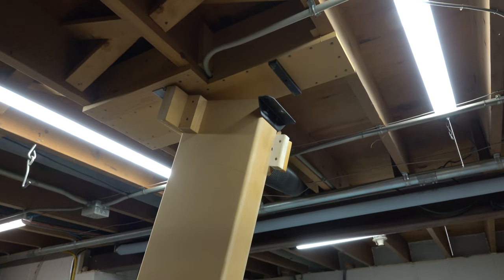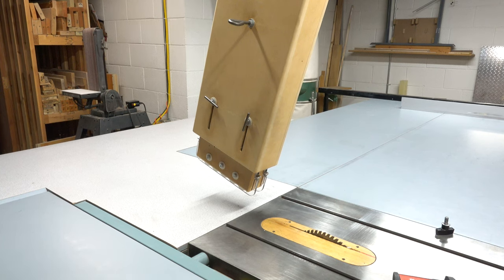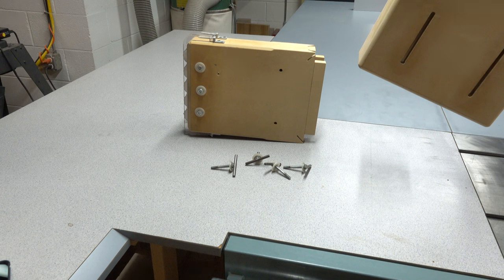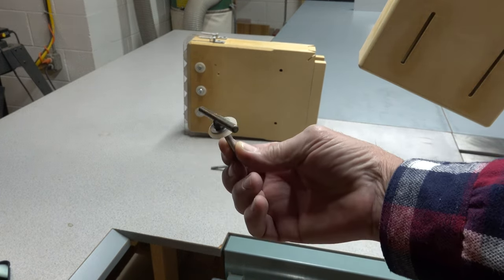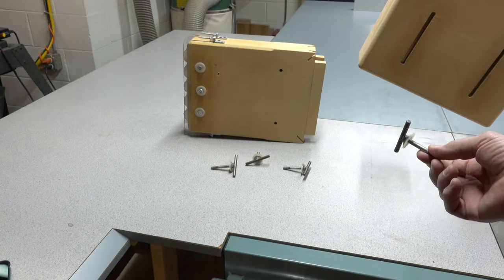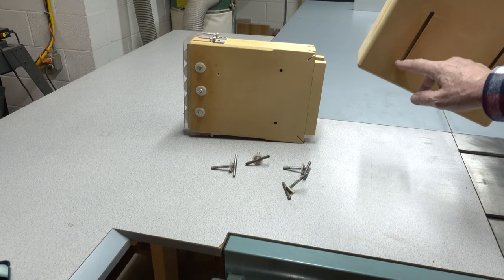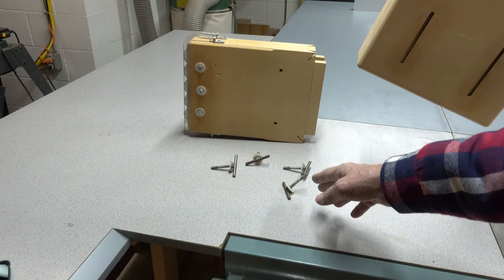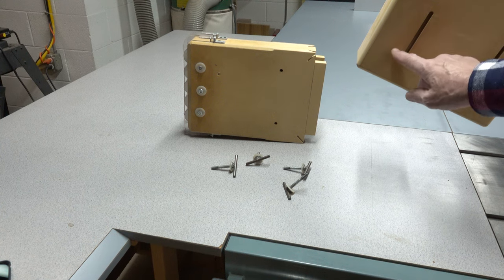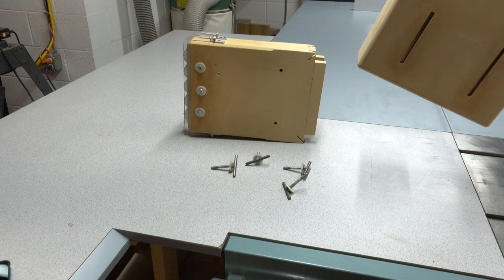Let's have a look at the inside of this thing and what makes it all tick — the meat and potatoes, the inside of this snout with the wheels and everything. Now what we have are the four bolts I just took out. I just have a washer on the end, then after welding it on I put a washer and then just a piece of nylon washer after that, so you don't mar up the wood on the side when changing it up and down. I did a light coating of CA on here and then re-sanded it so it makes it really strong on top. And then I never over-tighten these — you don't need to. Lightly snug, do not over-tighten. This is 30 years of use and I have no divots on here from over-tightening. Light snugging provides so much friction — it works fantastic.